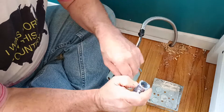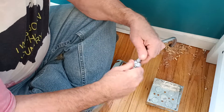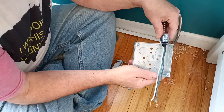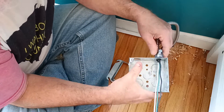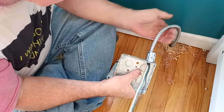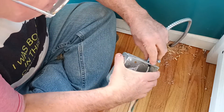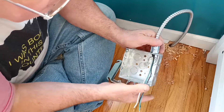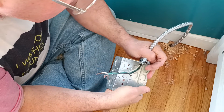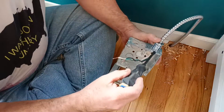When you tighten that screw it closes down on the cable. We'll stick our wires through here, bring it down, get that little saddle up over the cable like that. We'll go into the bottom of our box like this, get it on over the clamp — it should just fit right in here, but if it doesn't we'll just use another one. There it goes, in like that.